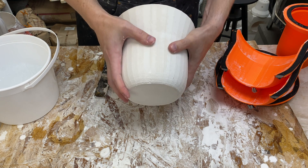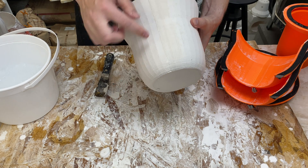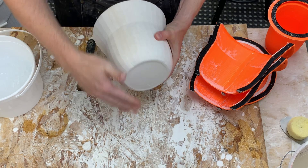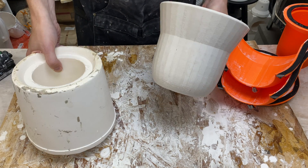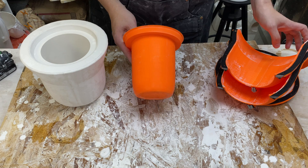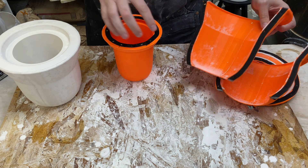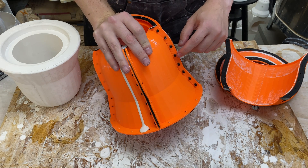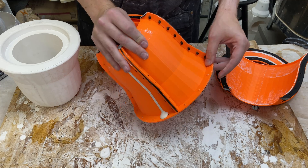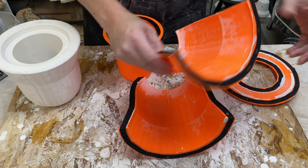We have one brand new mold. The top is nicer — there's a little plaster flash but I rounded it off, so I just run a putty knife over it to smooth it out. I don't see any bubbles, which is great, and we have a good copy of the inner mold. There are a couple of small bubbles on the outside, but that's not a critical surface. Compared to the original mold, this is a much nicer, smaller mold. We can reuse the 3D printed mold — just wash off any plaster. The gasket should last indefinitely, though the bolt holes might eventually compress or strip after several uses.